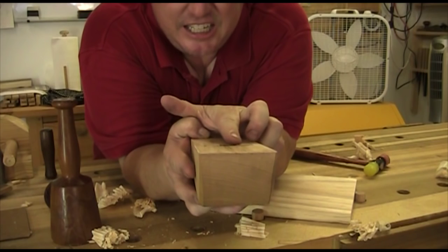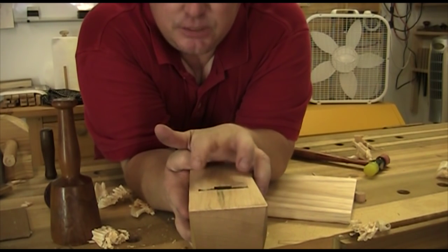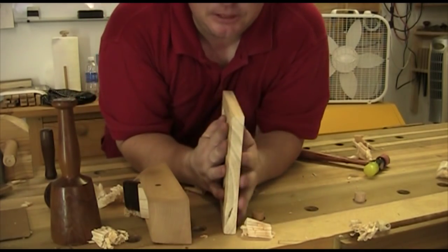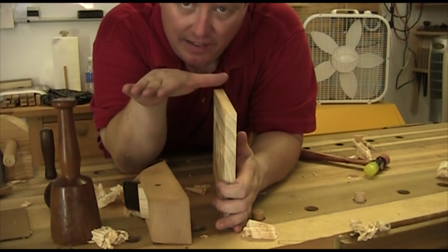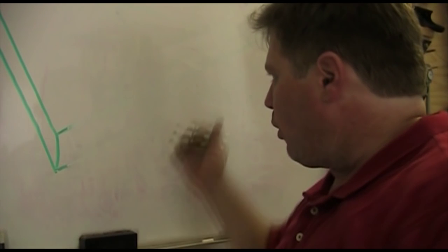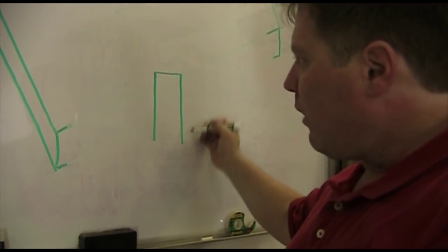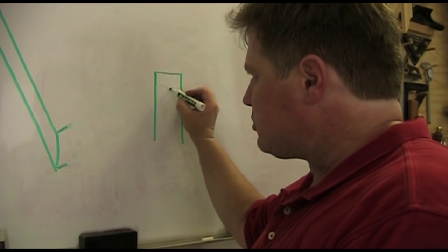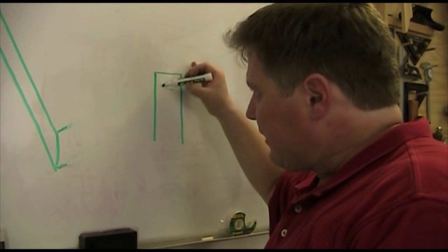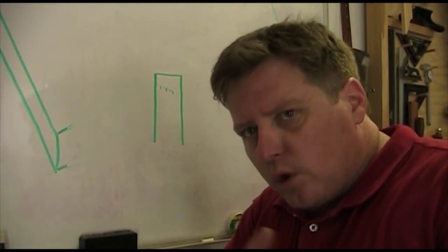This is a surface that is ready for finish. Now, if you're ever jointing an edge, the misconception is that you have to have it dead flat. In actuality, having the slightest of curves — we're not talking much — can be a benefit. If you're jointing the edge of a board and you have a dead flat blade, and you get it off skewed a little bit so the edge is at a slight angle, the only way you can readjust is by readjusting the blade on your plane, or coming back and cutting off just one portion, then moving over and cutting off another portion. So you're taking swipes on just a portion of the board, which is kind of hard to balance.